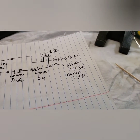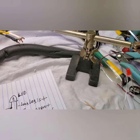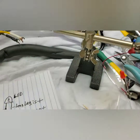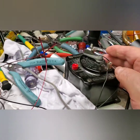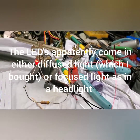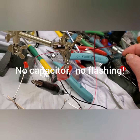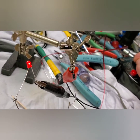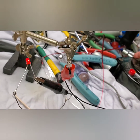I have one over here hooked up. I'm going to shut the bright lights so you can see it a little better, because it is a 3 millimeter LED. I'll turn on the transformer — see, I've got a little tiny transformer here. And there it is. That's the threshold voltage — it's probably around 9 volts, 7 volts. And I turn it all the way up, and as you can see, there's just about no difference.